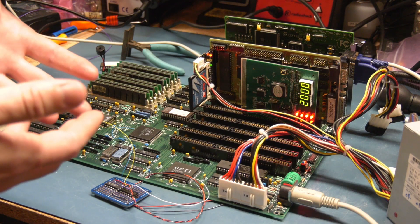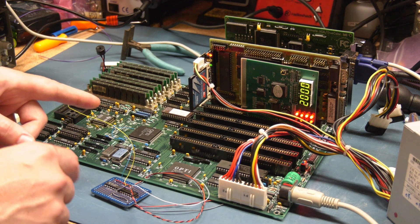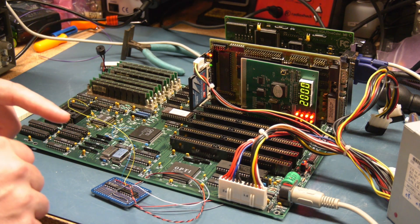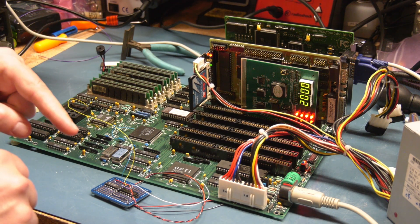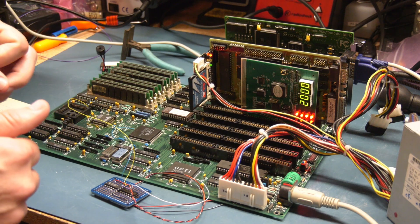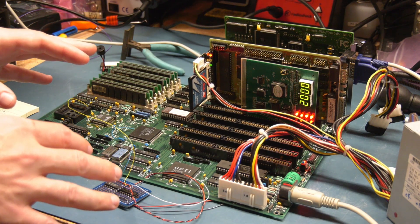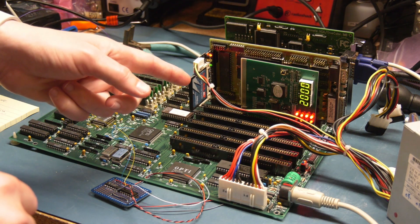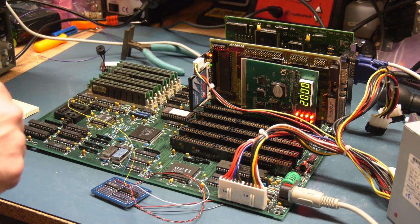Now I've been trying to get the level one cache to work. This is discrete circuitry for the flush function on the chip. I believe it needs to stay because the cache controller here doesn't necessarily clear the cache every time the processor gets put on hold. I'm going to do a little experimenting to see if I really need this cobbled onto the board. You'll also notice there's a CF card in here — the BIOS update fixed the hard drive problem I was having, so I'm able to actually boot from a hard drive, which is way faster and easier for troubleshooting.